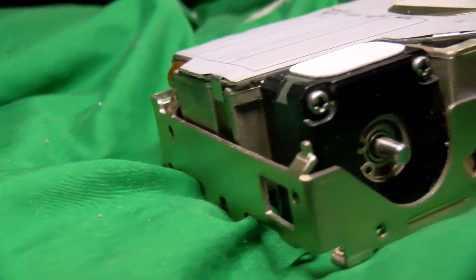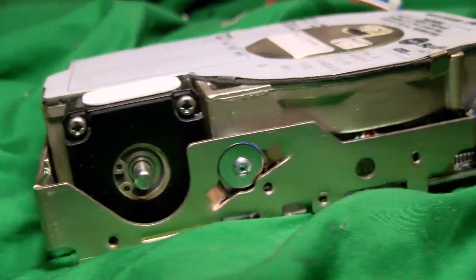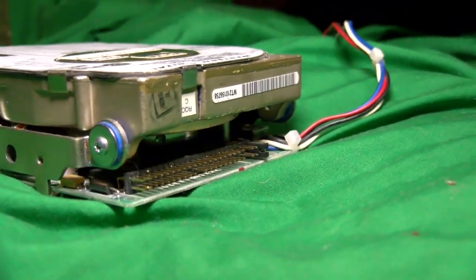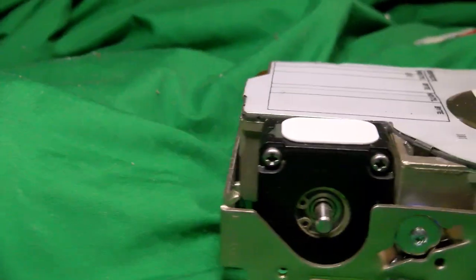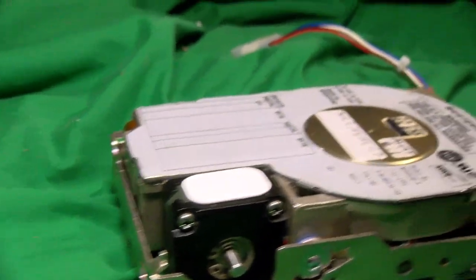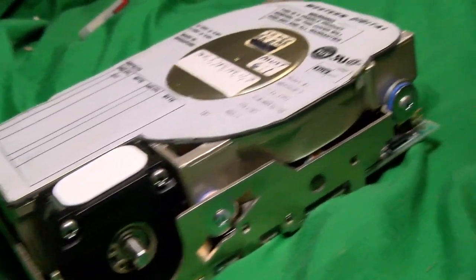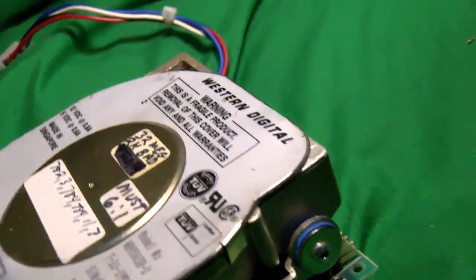Why it took so long to get that onto 16-bit IDE, I don't know, because even by the mid-90s, it's an option you have to manually play with, and the auto-detection isn't always reliable. I'm not sure how much work the EEPROM on the card does. You'd think it's just hooking interrupt 13H, and we actually did look at that with LameGuy64, and, well, yeah.